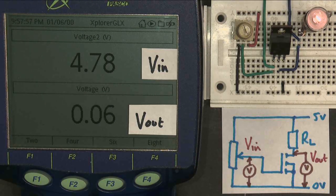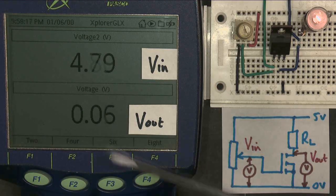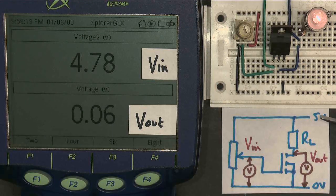A word about using the MOSFET as a transducer driver. This MOSFET is controlling the current for the bulb. At the moment the MOSFET isn't getting hot, and the reason is because although there's current flowing through the drain and out of the source through the MOSFET, the voltage across the MOSFET is very small. So the power, which is V times I, is also very small. The MOSFET isn't going to get hot.